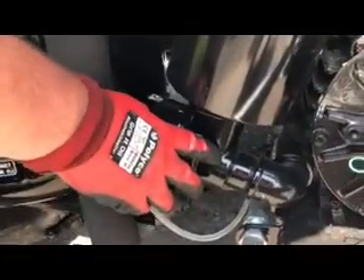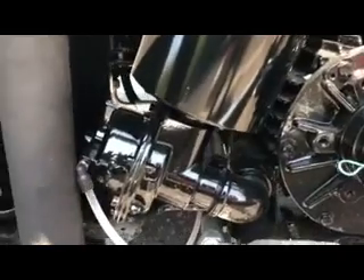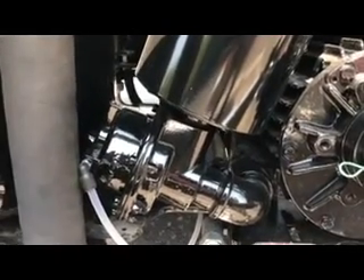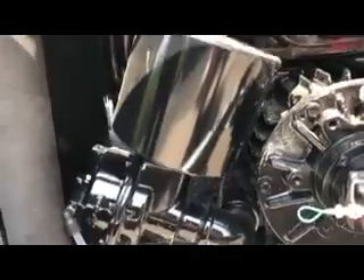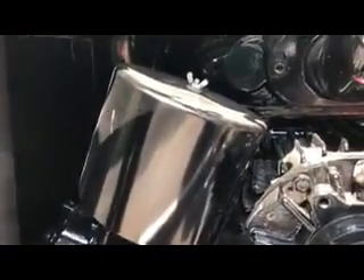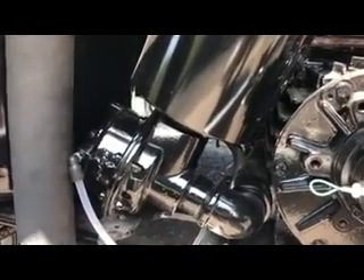That's the Solberg valve, or the DV4 — it's an automatic snifter valve that opens to really reduce the vacuum and stop the tank from imploding, technically. There is a filter in there, but we don't need to worry about it too much. It's a paper filter with a sponge around it, and because it's only allowing air to get into the machine, it doesn't get very dirty.